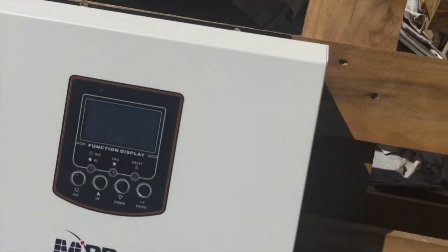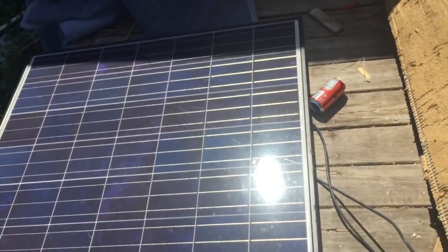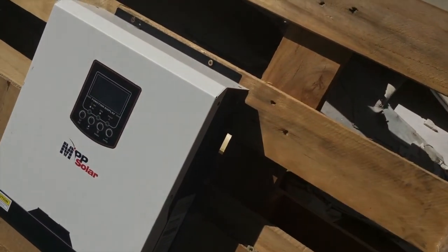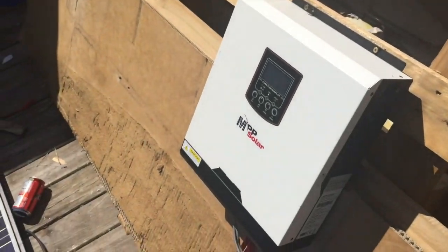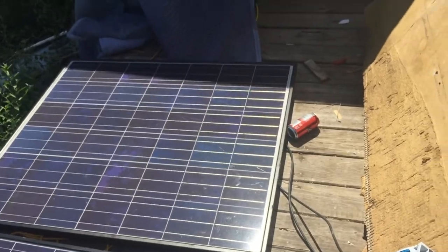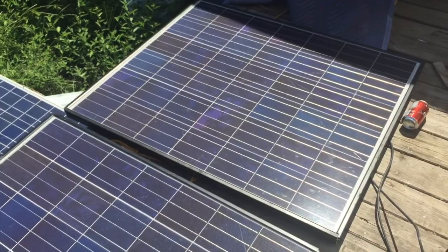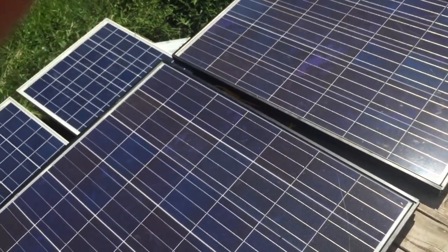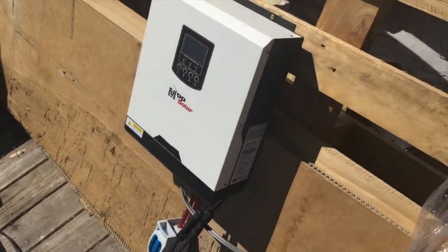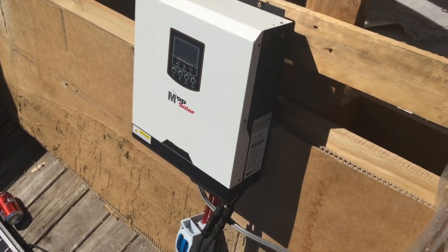Error 5 — that's the first time that's happened today. I think it's because I'm finally starting to get shade on these panels. The system is primarily running off of my supercapacitors, and I'm glad I caught that on camera. The solar panels are charging the supercapacitors, and as soon as those panels get shade, the voltage drops. Whatever is inside pulling voltage is going to eventually drain, so that's one failing point of my power system — but this is in test phase.